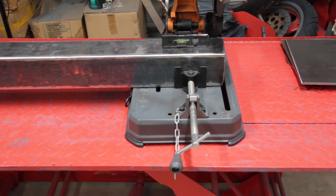I have the chop saw set up. Notice I have a level sitting on the square tube — I want to make sure I square those ends up exactly so when I weld the quarter-inch plate on the ends, everything will be square to the ground. That way, whatever I mount to the pedestals will also be square. I'll cut one end for you and then cut the rest off camera — you'll get the idea from this one cut.